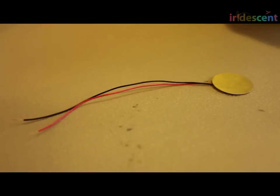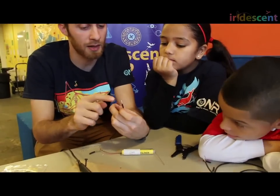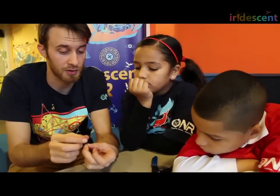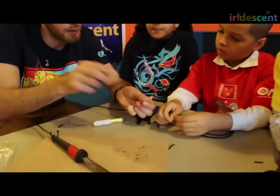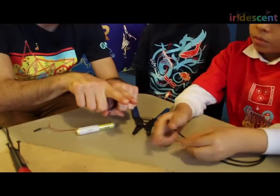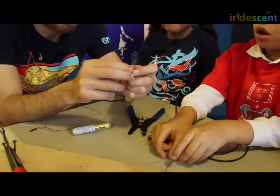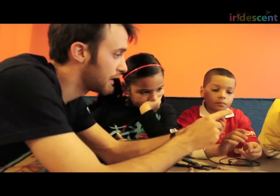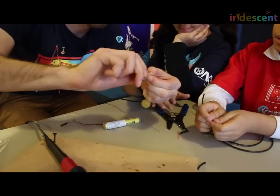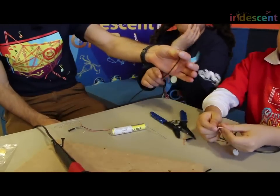We need to wait a minute for that. Do you guys all have piezos? We've got two wires coming out of the piezo and only two wires out of these three that we care about. Remember, if you have a white, a red, and another one — the red one we're not going to care about. We're making the connection between the white and the copper. It doesn't matter which goes to which so long as each one is connected. You take the two wires, lay them next to each other, then grab them and twist them around each other until they get all intertwined. I'm going to take the tiny wire coming out here and wrap it around the other wire — twist, twist, twist — and now they're bound up together. That's what it needs to look like before you solder it.